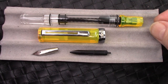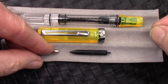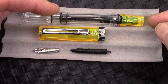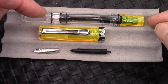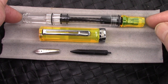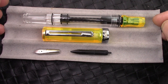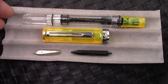TWSBI seems to have some types of issues with cracking, like Jinhaos do. A lot of that has to do with the mold cycling, the resin that's used, the plastic — there are a lot of things that can contribute to that instability. But if they cycle the mold properly and use a good resin, it should last as long as any other pen will last.